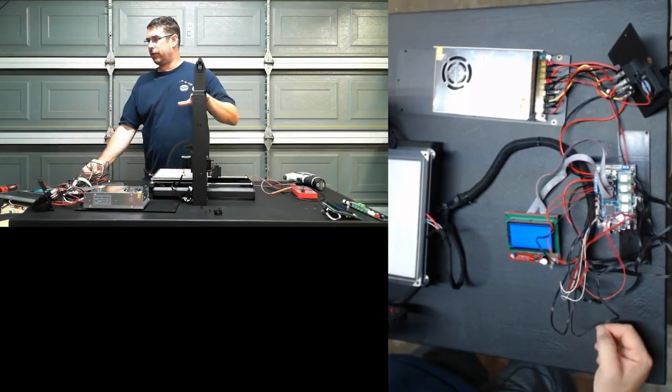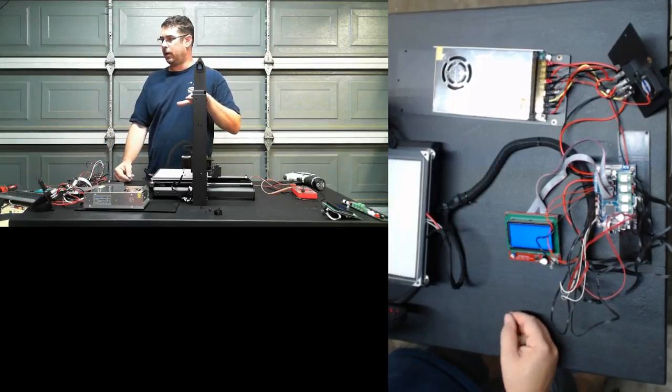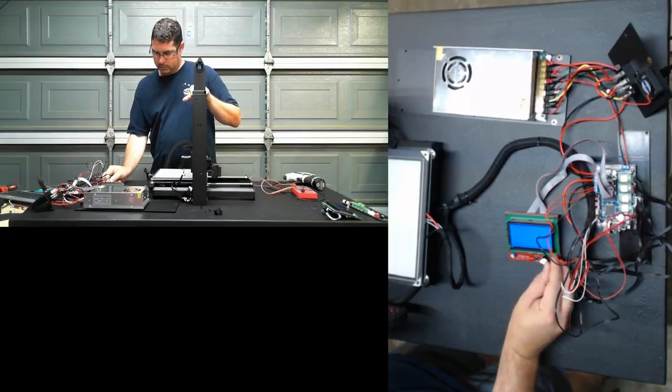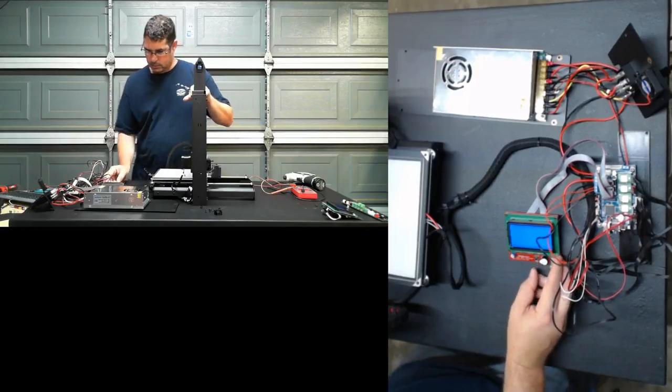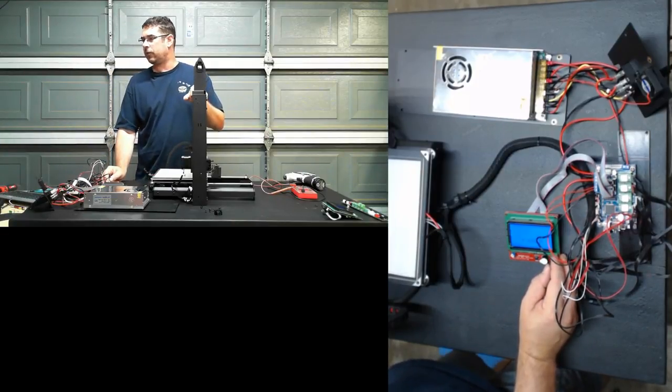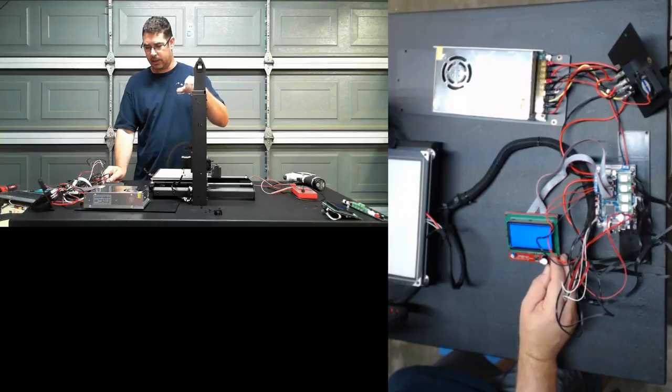So Ray, initial thought here is it felt like the entire machine vibrated a lot more when it was homing, and you think that's still under voltage on the Y steppers, or I'm sorry, the Z stepper driver. Ryan, yes, Ray is the owner of Cohesion3D, which manufactures the smoothie boards that are going into this. He's sponsoring the stream today and provided the boards and the kit that we're putting into the DI3 here.